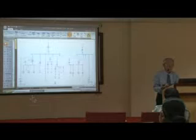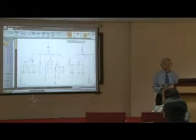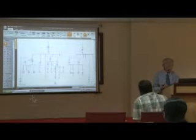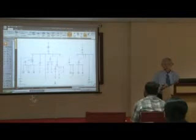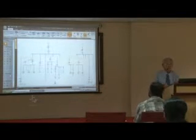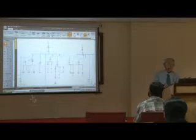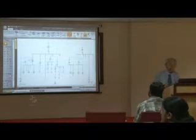But if you have a generator, you enter that data. So you can figure the stability, harmonics. I'm keeping away from harmonics. You need the third harmonic. Maybe there are other harmonics. And we have some adjustable frequency drives there, and they're just known problems with the harmonics. You generate harmonics, come back in the system. I saw one number that 2/3 of the harmonics, when you have a problem, are generated within the system, and 1/3 come from outside. I think most of them are generated within the system.